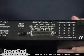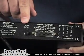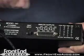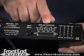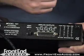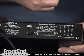Turning the unit around, we can see we've got our ADAT input, which will accept 44.1 or 48K, and it outputs analog standard DB25 TASCAM wiring, which we have those cables available or we can custom build them for you as well to fit your needs.